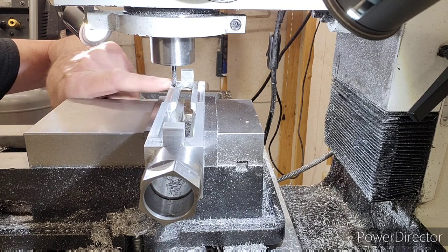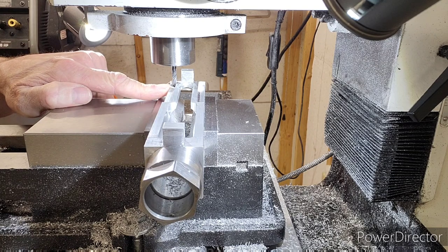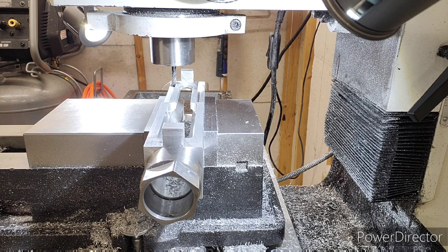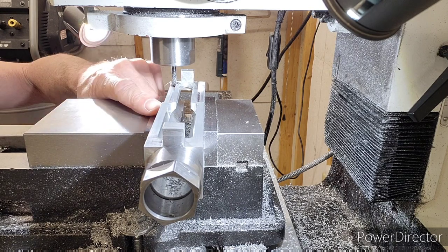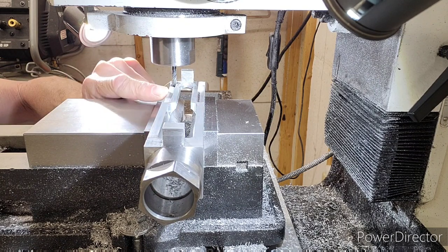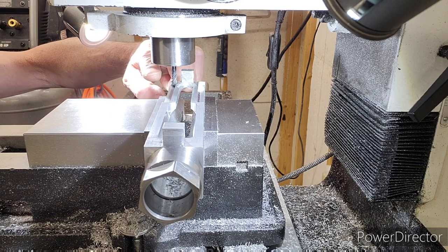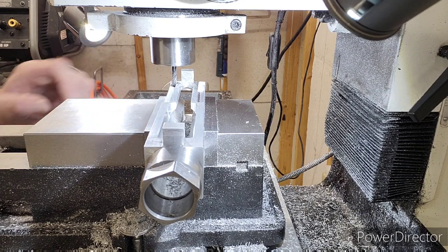Our cut has already been done to 535 deep. Our finish was 533.75 — in other words, 534. So I'm one-thousandth off finish. We're sitting at 534 right now. We've already cut our length here, so this is basically finished other than coming out, dropping Z down to 250, and going in and cutting back all the way to 534. We're going to do that on both sides, and then come up and cut this in-dimension right here.